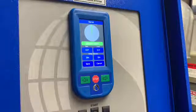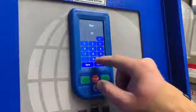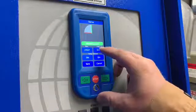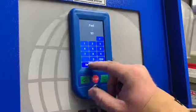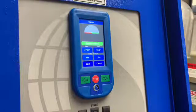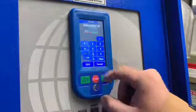In order to set your reverse barricade, you must touch on the blue icon below the Reverse button, enter in your degrees, and press Save. Then go to Forward — the blue icon below the Forward button — enter in your degrees, and that will show where your barricades are on the main screen. If you would like to have a delay interval, enter it here on the reverse side, and it will be in minutes. You can also go to the forward side.